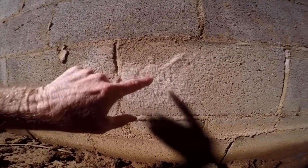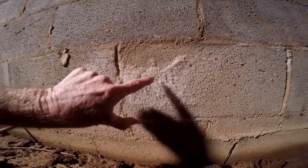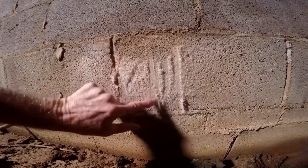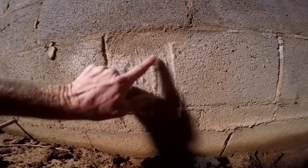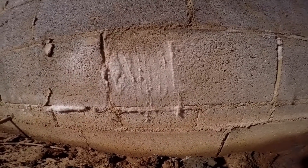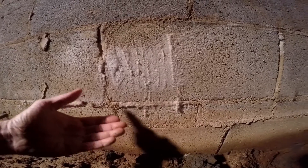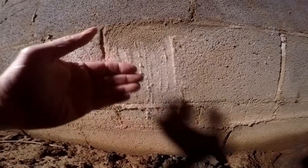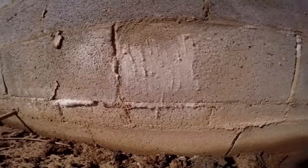We're going to put gravel all the way around the pit; that helps water get into the pit as it comes across the crawl space floor. This right here is a good example of efflorescence. You can see it looks like a cobweb — this is water in the block. It's caused by a reaction of Portland cement and water. Water gets in behind the block, fills up, and starts to push this stuff out. It's just salt — a sodium compound.